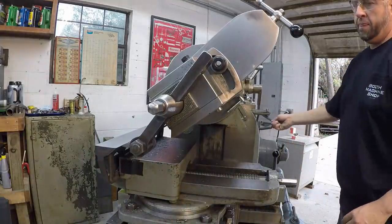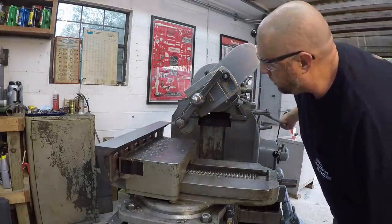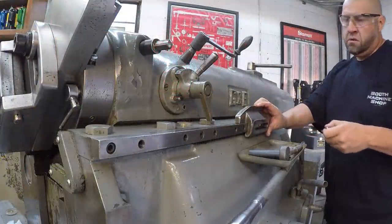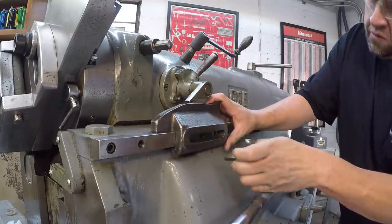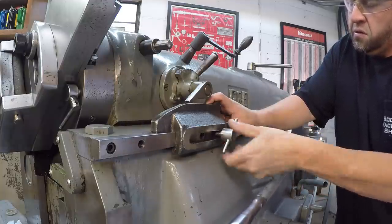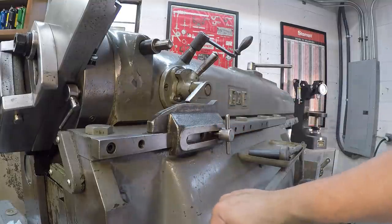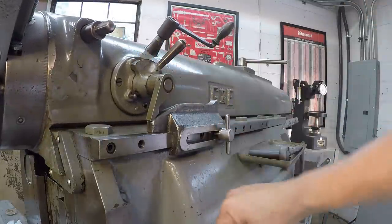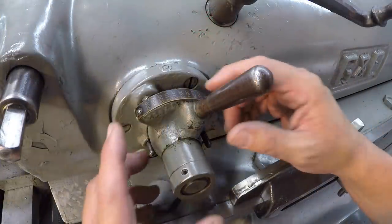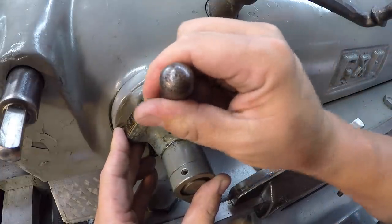Tool up. All right. Get our down feed cam plate set up right over here. Motion, and make sure we're in our right position. Zero down right now. We're good to go. This one adjusts the amount of feed. I think we'll just go ahead and start off with 20. That'll be 20 thousandths down feed right there.